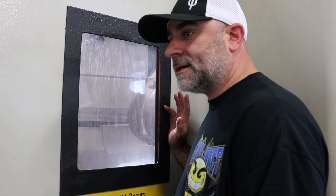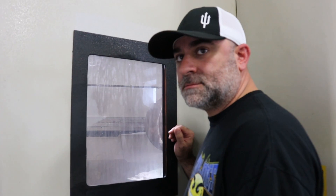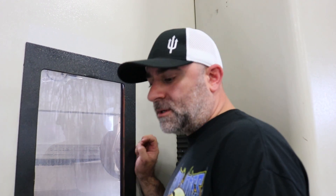At the end it'll look a lot nicer than just an engraved letter. So why does it take longer to use the small bit? Well, smaller bits — you can only feed them so much and then they'll just start breaking or chipping. The rigidity of the tool is less than, say, a half-inch end mill. On this one we're using a sixteenth ball nose end mill to actually create the outlines of the letters and bring them up.